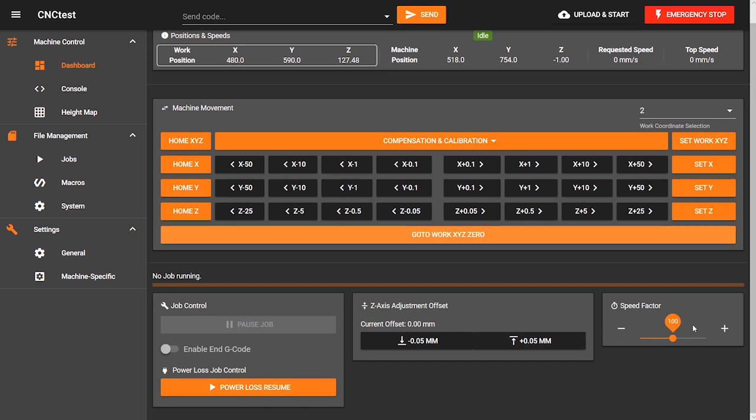What I'm missing here are more issues with the Duet firmware. For example, the job pause doesn't occur in real time and will execute remaining G-code segments, which isn't really safe or practical for CNC where a lot more can go wrong compared to 3D printing. And a spindle PWM speed adjustment, although I've found it's easier to set up a toggle switch and potentiometer directly to your frequency drive.